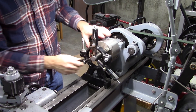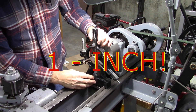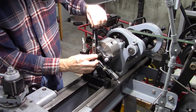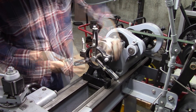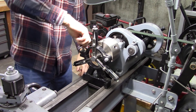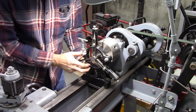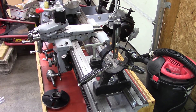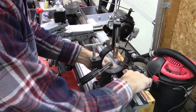I've got a short section of 3/4 inch stock in my chuck right there, and I've got my steady rest mounted up close to the chuck. I'm going to set the fingers so they're just barely snug on that 3/4 inch. Now the steady rest is set up. I've moved my steady rest down to the tailstock end and got my tailstock removed.